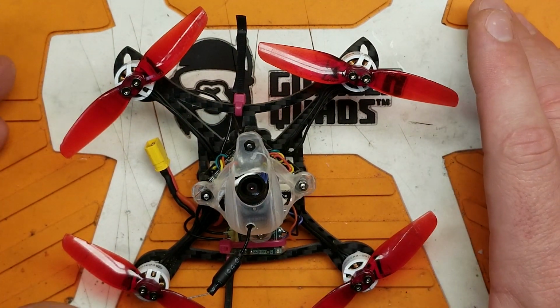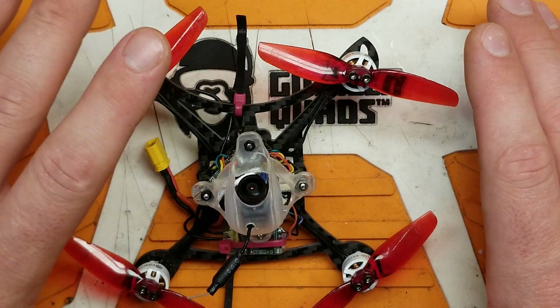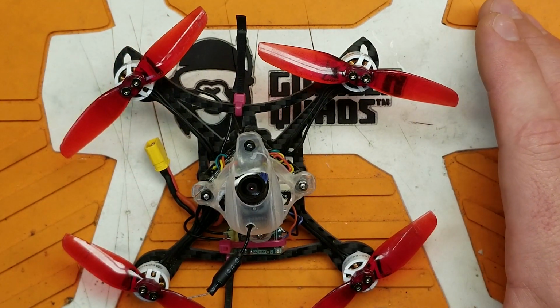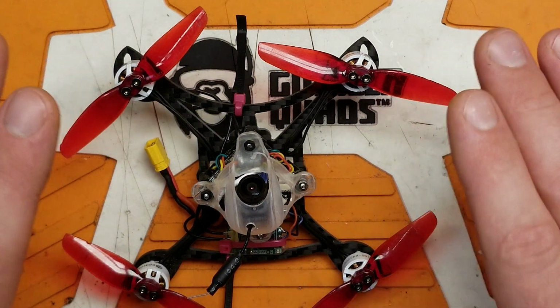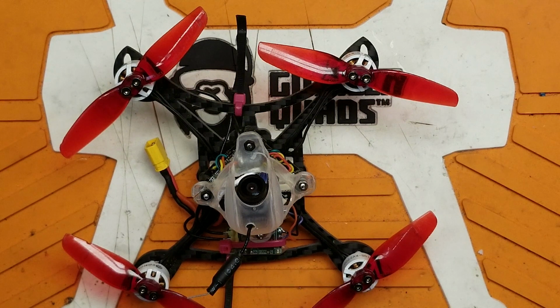But I really wasn't happy with the way it flew. The onboard receiver on these SPI flight controllers, I've had fairly decent experiences with them in the past if I use D8 mode over D16. In D8 mode, I could maybe get 50 yards. I switched to D16. I was lucky if I could get 10 yards out of it before I had a failsafe. The receiver in this particular model, the one that I have, is utterly horrible. Just a flaming turd. Awful, awful reception.